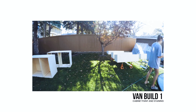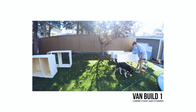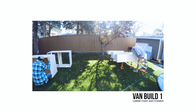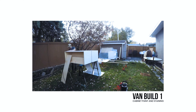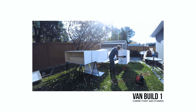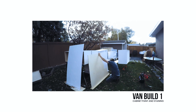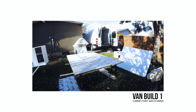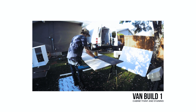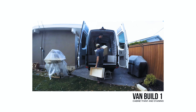they included four coats of paint on all the white painted surfaces, and all of the stained surfaces included one coat of stain and then three or four coats of clear polyurethane. In between each one of those coats included a full sanding with between a 200 and 400 grit sandpaper before the last coat was applied. It was a ton of work. The finished product did turn out very good, but it's one thing most people do not take the time to do properly.